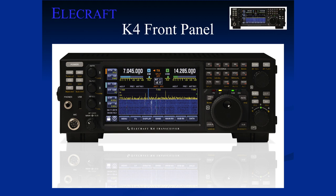We have basically been SDR for some time. If you have the KX3s, especially the KX2s, those are not direct sampling but we direct convert down to baseband and immediately sample the IQ into the DSP processor. All the back-end filtering, noise reduction, modulation — everything is taken care of at that level. It has one level of mixer but no crystal filters or anything like that. We've been on that route for some time.